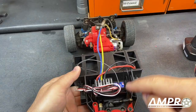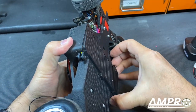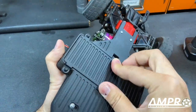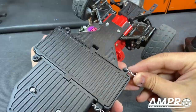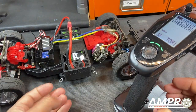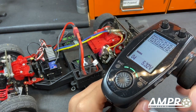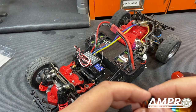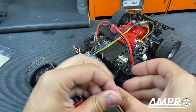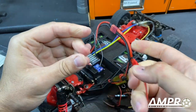Let's go ahead and install this. Got the new receiver in — let's put the battery in. I'm going to install a 6,000 milliamp lithium polymer battery, which goes just like that. When the body is on, I just plug it in first and fish the power cable through. We'll plug this in, turn the radio on, set up a new profile, and turn the car on.